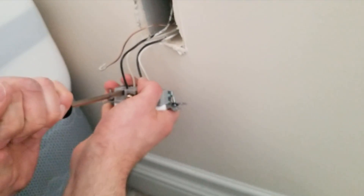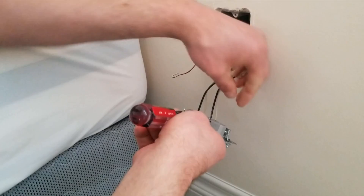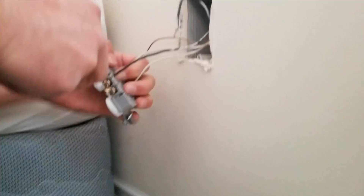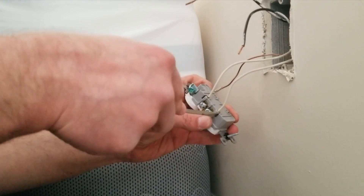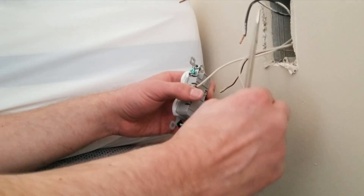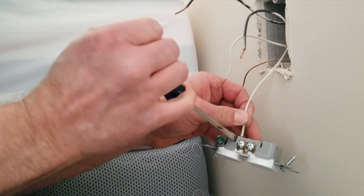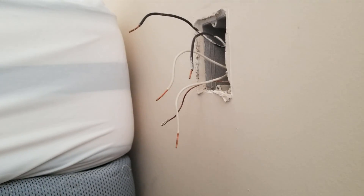Sometimes they're a little bit tricky and you've got to put a lot of pressure on them. You can see how that comes right straight out. Be careful where your hand is — you don't want to jab your hand. Put a little pressure inside the flat blade screw slot and then it pulls straight out, using the pressure in the wall to pull back against the wire until it pops out. Once you release the little lever inside, they'll pop right out of the hole.